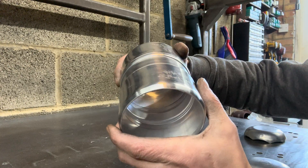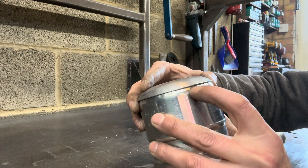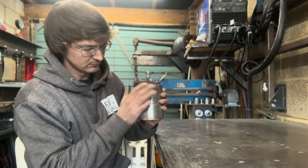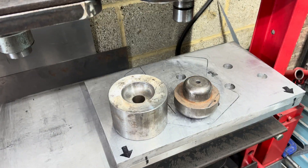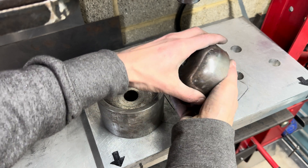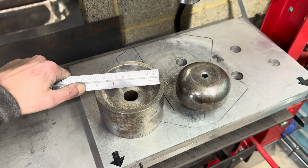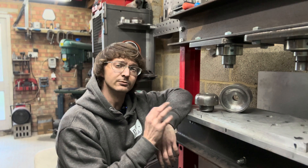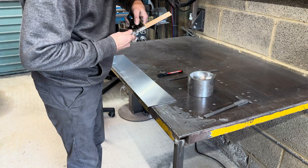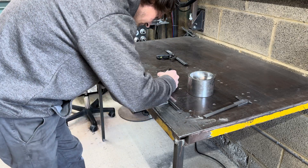With this detail added, we've created a small step to fill with weld, which will prevent the weld from disturbing the overall shape of the tank. Now the body is fully prepped for a dome cap, we're going to go over to the press and look at the tool we'll use to make them. This brings us to our first pressing tool of the day — another tool made by Adam at Rapid Engineering. This tool has the option of two different cap sizes, made to suit two completely different sizes of tube. We have two different ways of making them fit our job: the first is the hard way, where we'll be manually marking and cutting the blank.